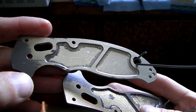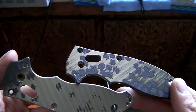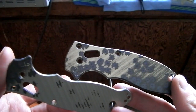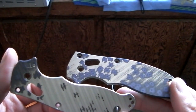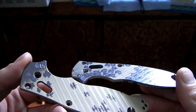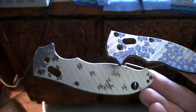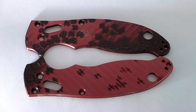This is weird. I don't know if it was maybe a bad electrical connection, or — I doubt it was bad aluminum. They were just as clean as all the other ones; they passed the water break test. I do them exactly like I always do them, and I did three other sets of handles at the same time and they all turned out perfect.